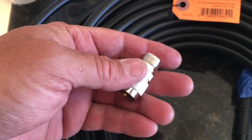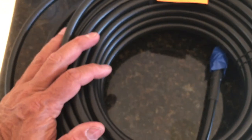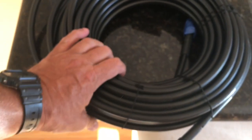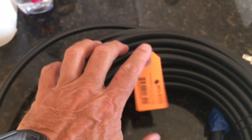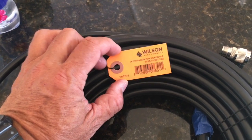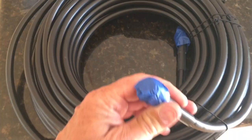I've had to buy adapters from eBay — I'll show you the adapter setup. While I'm up on the roof I'm also going to run a feeder line of Cat5e cable and poke that up through the hole too. This LM400 cable is really hard to work with. Wilson is the manufacturer — they make these cell phone amplifiers — and this cable is supposed to be equivalent to the very expensive LM400 from the top manufacturer.